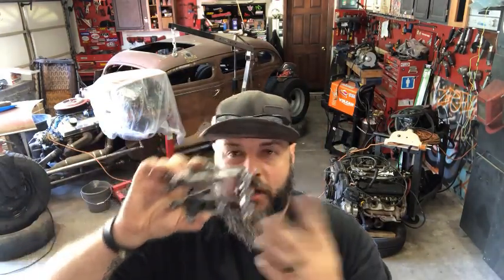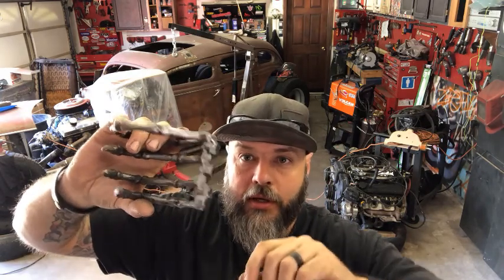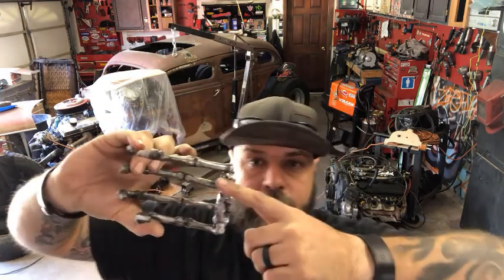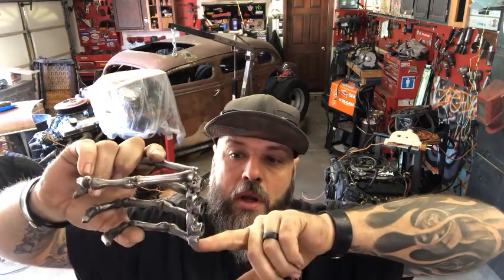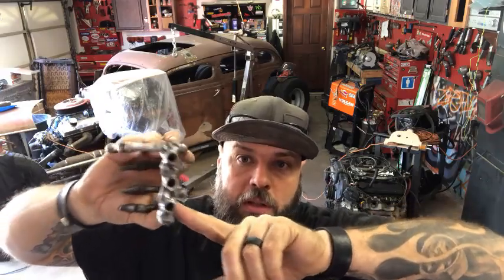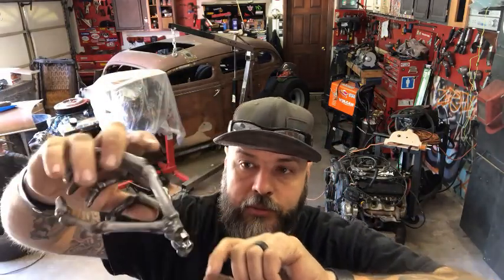If you're looking at the back of it, all this here, it'd be the wrists and whatnot. So what I did is I took different sized nuts, mainly 3/8, some smaller stuff, and I welded them together to form it, okay? To give me my spacing and the structure for it. Now, I did a sloppy kind of weld, okay? It's strong, it ain't coming apart, but since it's a sloppy weld, when I lightly ground it, it kind of looks like bones in there, okay?